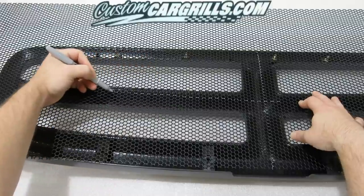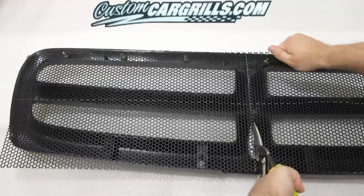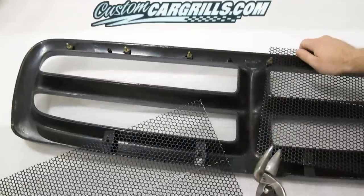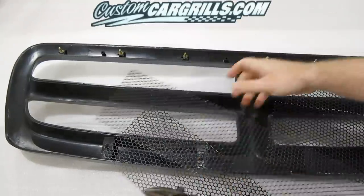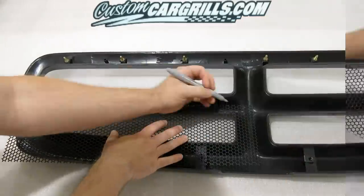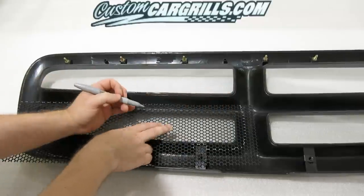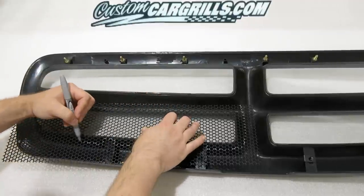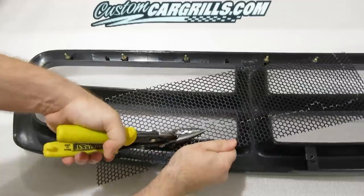I'm simply just using a silver marker to outline roughly where I need to cut this sheet. The first cut will simply be right up the center of the sheet, so this way we'll have a left and a right side of the mesh to work with. Then with each left and right side, simply cut those in half so that we'll have a top and a bottom to work with. All of these pieces are going to be a little bit oversized. I'm going to go ahead and mark off a slightly more refined outline, also taking note of where some of the tabs are that may become troublesome later on. Now I'm just going to cut along the line that I had drawn out. In this project, I'm just using a basic pair of tin snips to work through this material. It's relatively easy and quick to cut through.